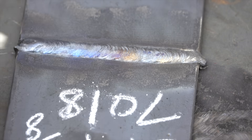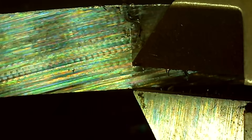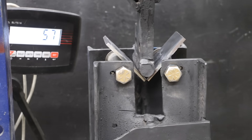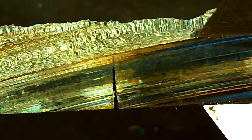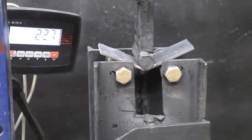The Simder produces more current than the S7 and made better penetration at 1.09mm — about twice as deep. Unfortunately, a mistake applying force to the wrong side of the Simder test piece means those strength results must be discarded. The Hone delivers around 138 amps and has the best-looking weld yet, achieving 4.65mm of unfused material — about 1.7mm of penetration, the best yet. The Hone test piece made it to just over 400 pounds before the weld broke.